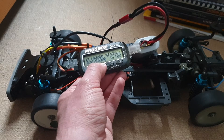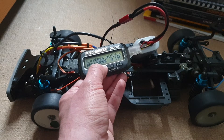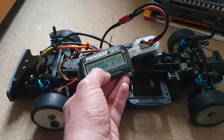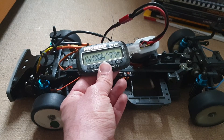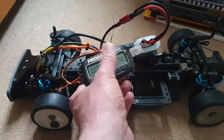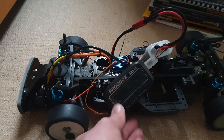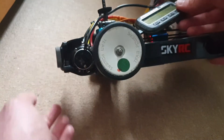Okay, so we have the results. In the future I'm going to change two things: using this program card, I'll adjust the boost and timing via the software on the laptop, because I prefer doing it on a PC rather than just a card. I'll also compare the same thing later by adjusting the timing on the motor.